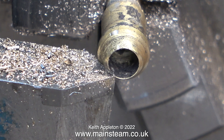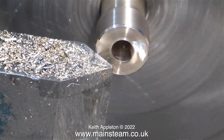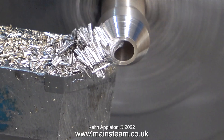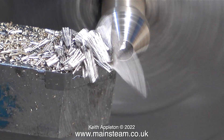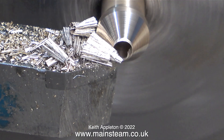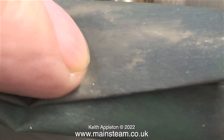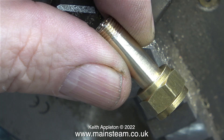There are many different ways to turn the end of a pipe union - this I find to be the simplest. I fit an existing pipe union cone into the chuck, then set the tool angle to exactly the same as the angle on the end of the union cone. I look at the numbers on the top slide's handle vernier, then fit the new part into the chuck and turn the end of the part to be exactly the same as the union cone fitted earlier. While doing this I'm looking at the part I'm copying for the distance between the tapered part and the bit that doesn't need turning. Once it's the same as on the union cone the job's more or less finished. I rotated the tool too quickly in the opposite direction so I didn't get the best finish, but it was improved by a bit of wet-to-dry sandpaper. Here is the finished component - a thread on one end and the union cone on the other.